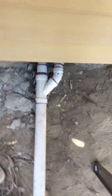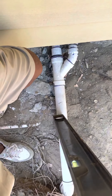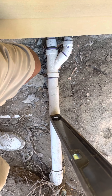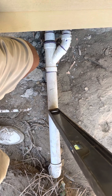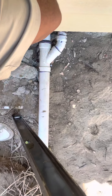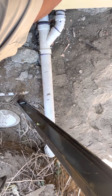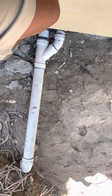So this one right here, this is the actual standing tub shower. So this has to be four inches coming out. When it leaves the building, according to our code, when the line leaves the building it's gotta be four inches. Because you're opening up and creating more suction running out. Everything goes from two to three to four to six to eight — everything just gets bigger downstream. It makes sense.